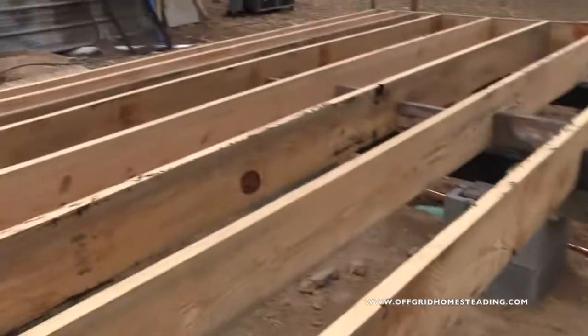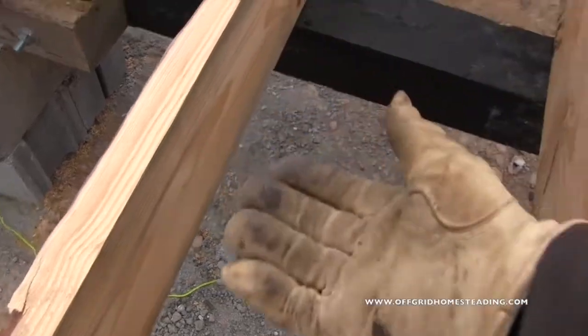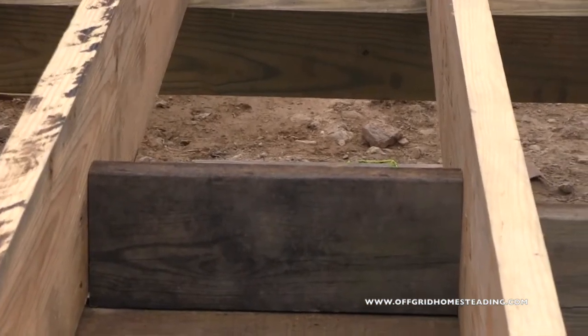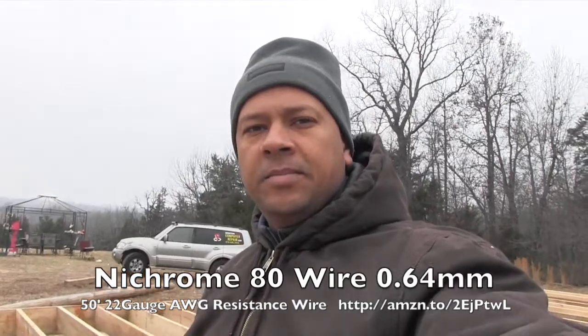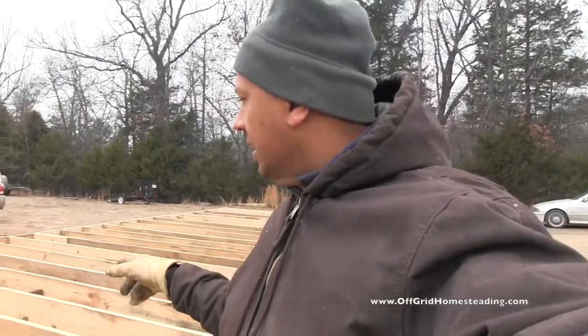I still need to finish the hurricane ties and get that done. We need to put some sort of board or strip down here so that the foam can actually sit right into the cavity — that's why we put these little center beams halfway down, so the foam can sit on top. I'm thinking about three and a half to four inches deep, but I need to calculate it. Two to three inches should be sufficient for the floor to keep our heat from going down. I'll put a link to the wire in the description; it's arriving Tuesday through Amazon Prime. By then I should have everything tied down, with electric wire and PEX running through here.